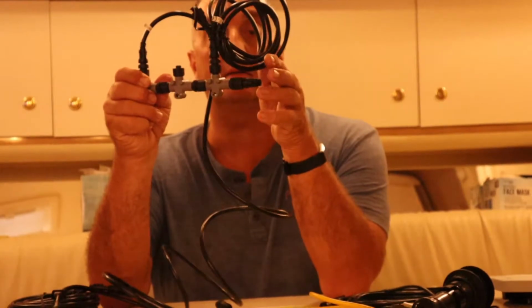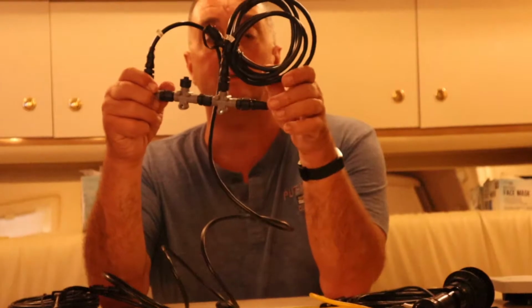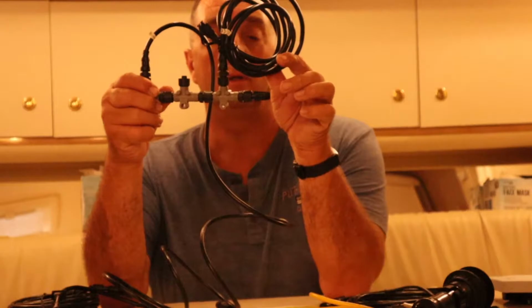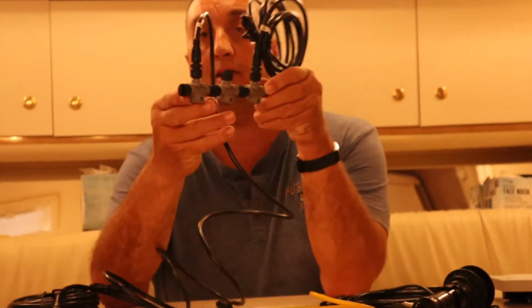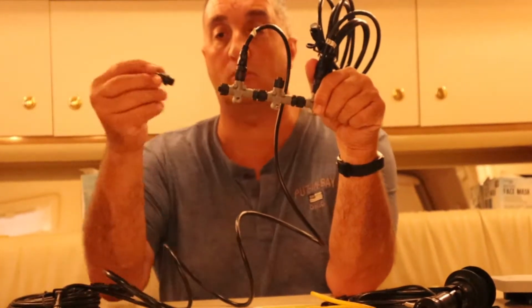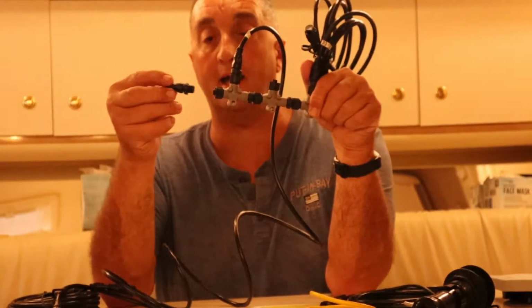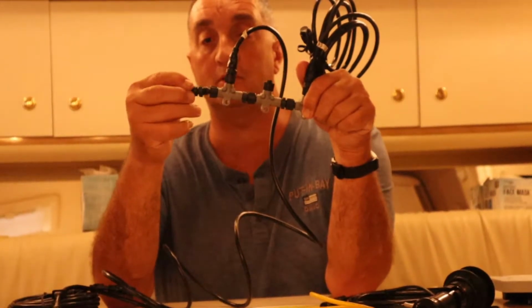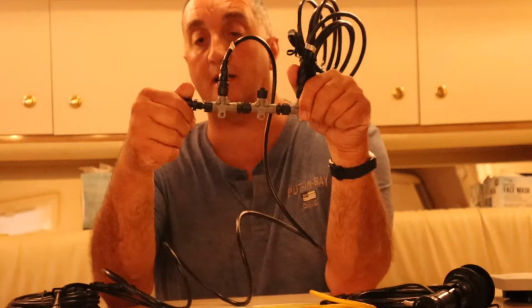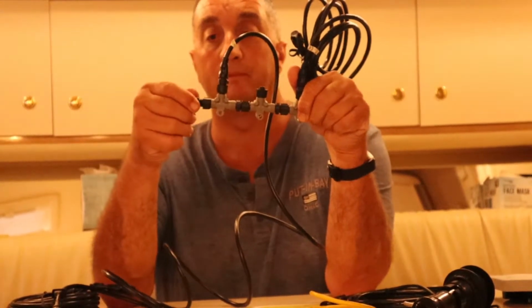At the end of these connectors are these resistors that you put in. This is the end of the line resistor, called Terminator Resistors. But you always put these at the end. You don't ever leave the end open. So when you're done with the run, and you can keep adding on to these, but when you get done adding on both ends, you put these Terminator Resistors in. And they just find the notch here, and then you can screw them in.